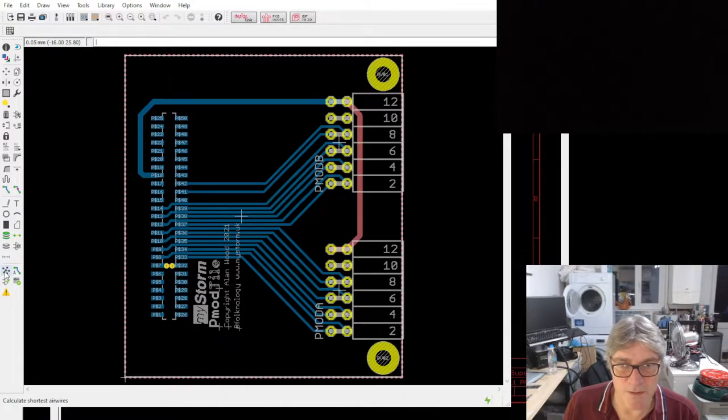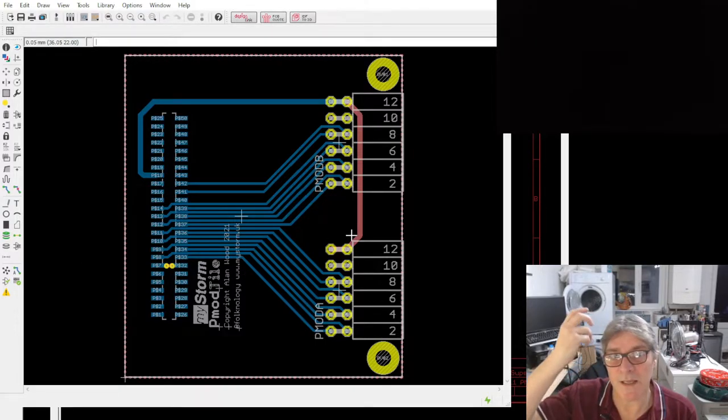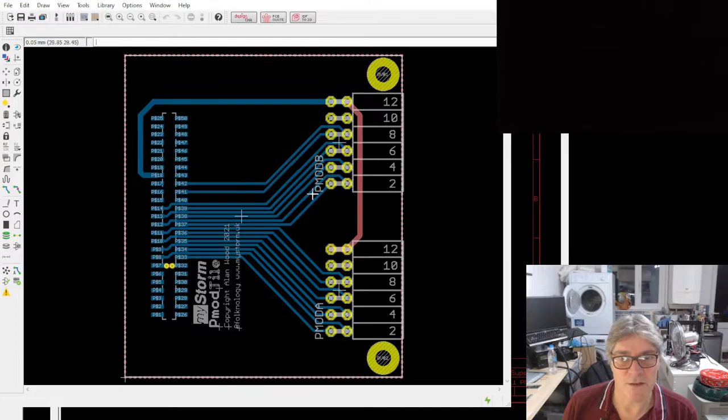So that's done as well, and that will only work in a super tile position because it needs all 16 signals. Most tiles don't have 16 FPGA signals, they only have 12. Only the super tile has 16 signals that are connected to the FPGA, and that's the center one. So it operates in a similar way to the way the earlier design worked. It's just that the PMOD functionality is brought to you by this super tile adapter.